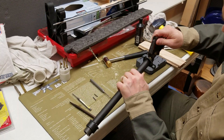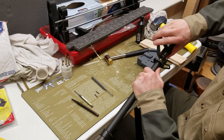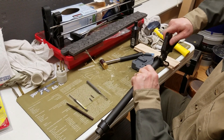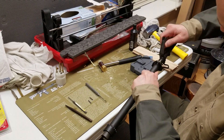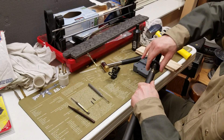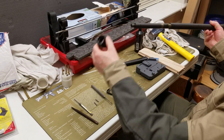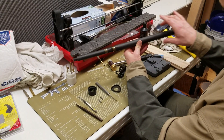Now it's loose from where it was and it's moving by hand pressure. You can probably see the gas port on the barrel. I'm going to work it all the way off, get the end cap and barrel free, and take out the old barrel nut, because when I put the match rifle together there's going to be a barrel nut with the national match free float tube.